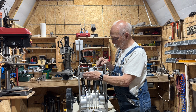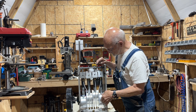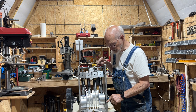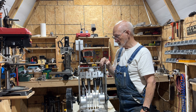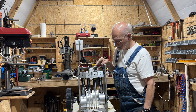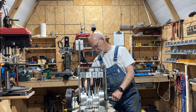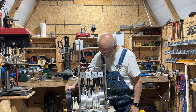After I got these all put back in, I decided I wanted to do some testing on how it might run and how much pressure I'm going to be getting on the actual cylinder, the valve, and the crankshaft. So I did some of that, and I had it hooked up to just one cylinder — number four. I had the air pressure set at 100 psi, and I moved it to get number four up to the top to see when the valve started to open.